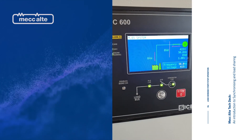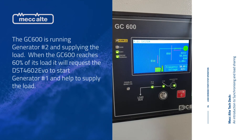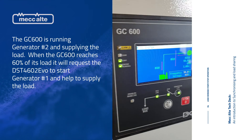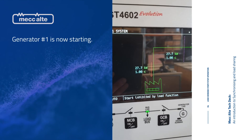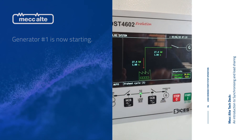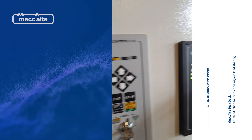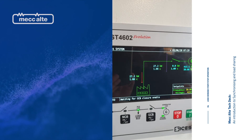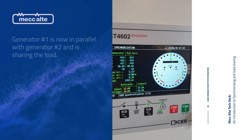What we're going to do now is demonstrate the system automatically starting as the load increases. Basically, when generator 2 gets to 19 kilowatts — 60% of its load — the DST is going to start up and close its breaker. You can see the DST is starting because the load is above 19 kilowatts. The reverse will happen when we reduce the load down to 12 kilowatts — then the DST will come off the bus and the GC600 will take 100% of the load.